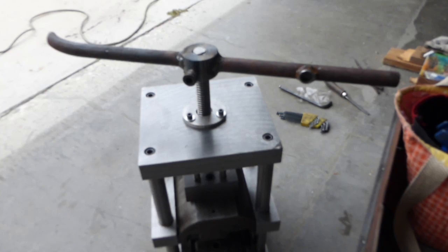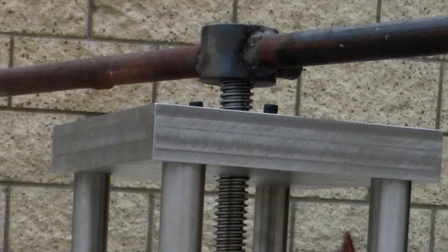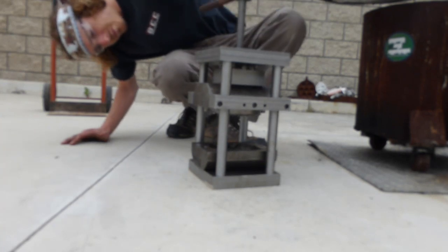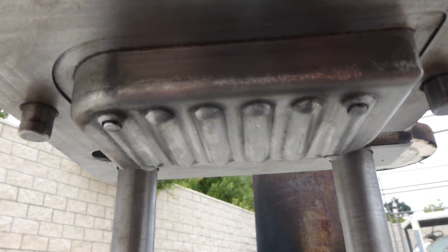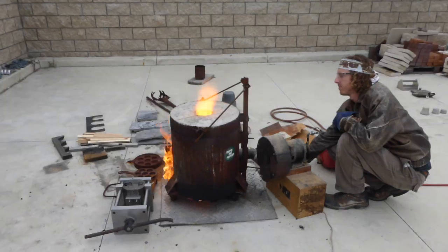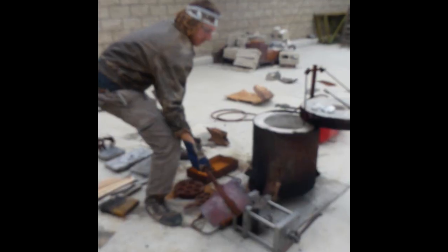And that is it — what a beauty! Here's how it works: you pour the metal in when it's closed — obviously not in the vertical position like this. When you open it, the ejector pin caps butt up against the back plate and push the ejector pins forward, thereby pushing the part out of the mold. Let's fire up the foundry and pour one — and the camera goes blurry right as I'm pouring.